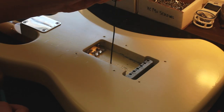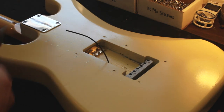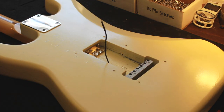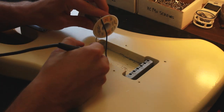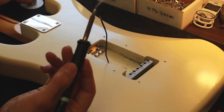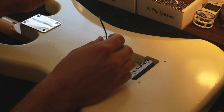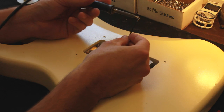With this wire through, we just want to snip a little bit off — we want a little bit of room to play. With these cloth leads, you can just push back the cloth insulation, and we're going to pre-tin both our connections. We already have a little bit of solder down here. Any time you're heating up something metal, you need a good strong soldering iron — make sure you don't have a really cheap one. This is an 80-watt; it's a little extreme, but it works. So I've just pre-tinned this lead.